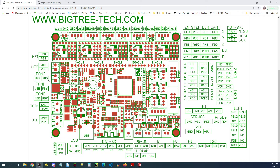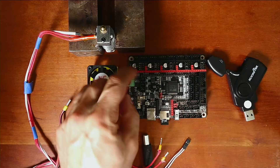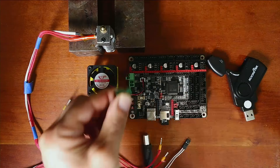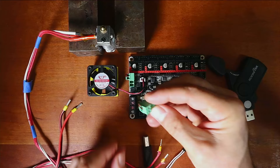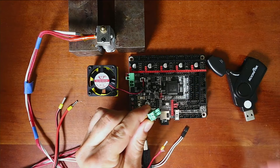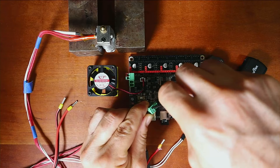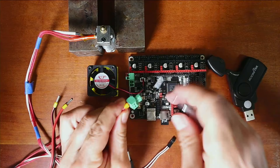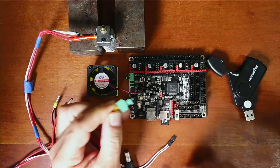Let's start with the actual configuration. I'm going to take the fan and plug it in over here. I'm going to pop the connector block out so I can populate it easier — I've already loosened it. I'll slide the wires in and tighten it down with a screwdriver so it doesn't come out while printing, because the printer can vibrate. The ferrule connectors protect against loose wires.